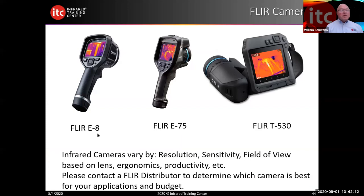Other camera types include the FLIR E8, which has been around for at least eight to ten years — it's been dropped, thrown, fallen off ladders. The E8 is very durable with a good resolution of 320 by 240. The E75 is a newer camera and all touchscreen with manually adjustable focus, where the E8 is auto-focused — giving better detail and easier use. The T530 camera's lens can articulate 180 degrees straight up or straight down, and I've found this very useful in property inspections, electrical inspections, and overhead power inspections.